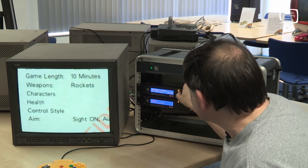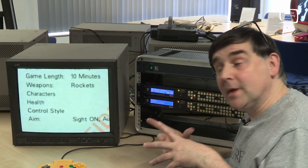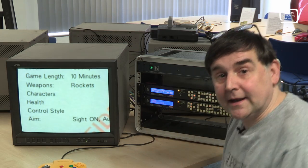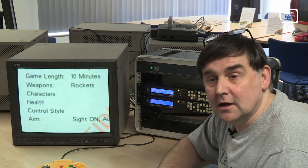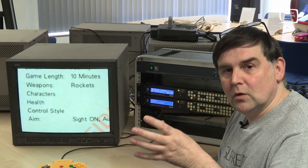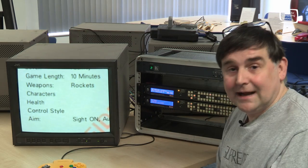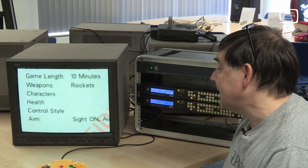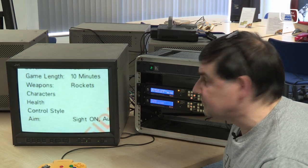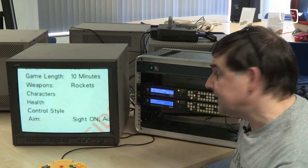There are a number of other features in here that allow us to make the picture a little bit better. Remember, the output from the N64 isn't that amazing anyway, even at full screen. What we're doing is really cropping into just that quarter, which on any standard PAL image is 720 by 576 roughly — so when we're looking at the quarter through the screen we're looking at 352 by 288 roughly. That's actually the same as the old video CD format. So even though it's pretty low resolution, CRT screens sort of cover up a multitude of sins — they give it a nice feel and it still looks pretty good.